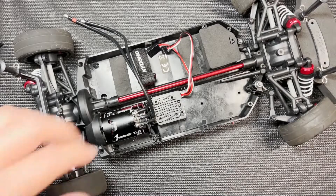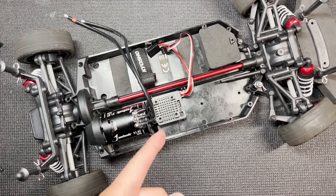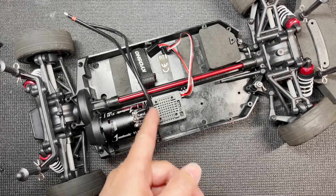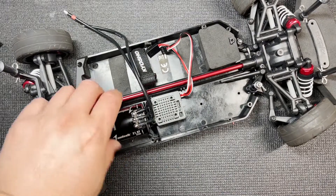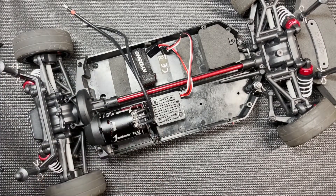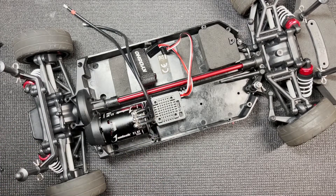All right, I'm back. These are soldered onto the motor now. When I was waiting for the soldering iron to warm up, I went to look for a short sensor cable. When I found one, I realized the plug is actually on this side of the ESC, just about right there. Fortunately, the motor wasn't mounted yet, so I lifted it and plugged them in on both sides, and I tucked it under the wire harness right below this.